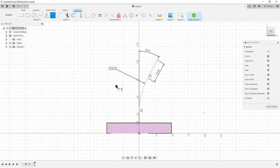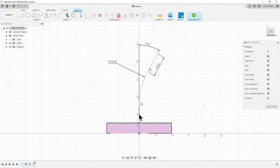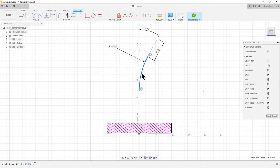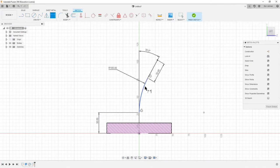Most things are locked in place now. This line here is black, which usually indicates something's completely constrained and can't be changed. These two are in blue, which means something's not fully constrained. I moved things around to see what was unconstrained and what was locked, and you can see it's the length of this line that hasn't been fixed at 30. So D for dimension, drag that out, type 30 and hit Return — now everything's jumped to black, which means it's fixed in place. I'm happy with that sketch, so I'll say Finish Sketch.